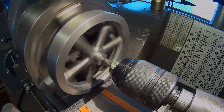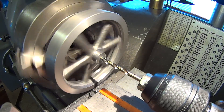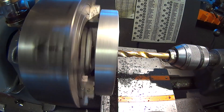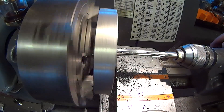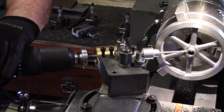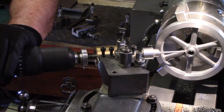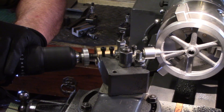Finally, the centre boss was drilled and reamed to suit the axle, ensuring that the flywheel will run true. I then set up my toolpost drilling jig on an angle to be able to drill a hole in the boss for a securing grub screw. This was then tapped out to M4 using a long reach tap wrench.